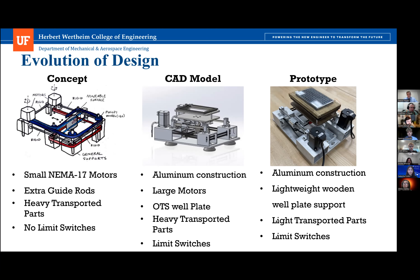In the prototype CAD model, we replaced the bulky motor mounts and carriages with much lighter hollow tube stock modified from off-the-shelf stock — more inexpensive, lighter, and more compact. As a rule, we replaced as many custom-manufactured parts as possible with inexpensive off-the-shelf equivalents, seen in the guide rods along the length of the machine and the carriages that slide along them. We used larger NEMA 17 motors that still fit the same compact spacing pattern while delivering quite a large amount of torque — important because test tubes filled with 50 or more milliliters of water represent significant mass requiring substantial RPMs.